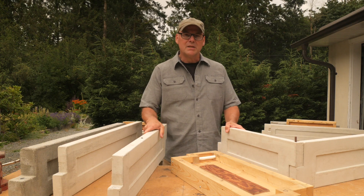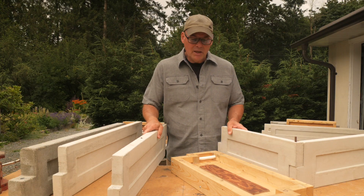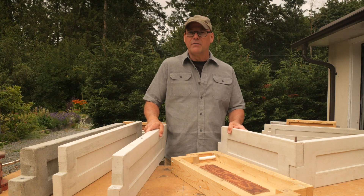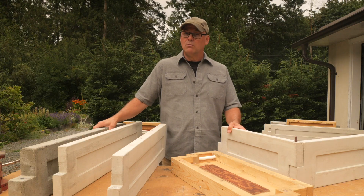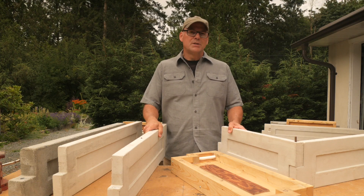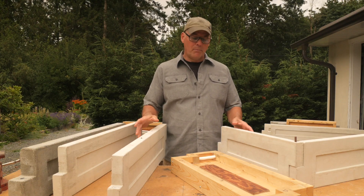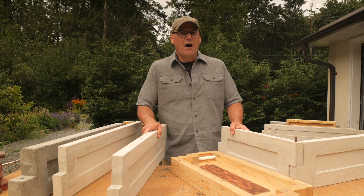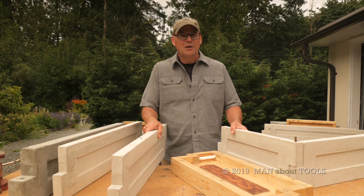A couple of things as I wrap up this episode in the series. I didn't know that this was going to be a series, but this is how it goes. The two previous form designs work well, so keep making panels with those if you have them. If you want the panels lighter, there are quite a few alternative concrete formulations available that work in those first two forms — I only covered three in the last episode, but I'm sure there are many more. With these new panels, I'm not sure if any wire reinforcing grid is required at all. The CSA concrete might be strong enough without it, so it might just be habit that I add grid. But if a panel were ever to crack or break, the wire would at least hold it together so it still functions. Please leave a comment with your thoughts or suggestions — I'm amazed at the wealth of knowledge out there, and I so appreciate everyone who has shared it. Thank you so much for watching, and we'll see you next time.